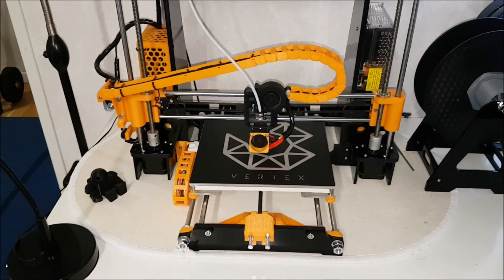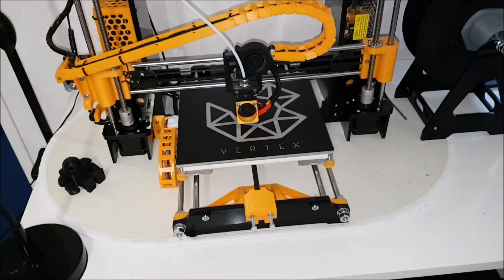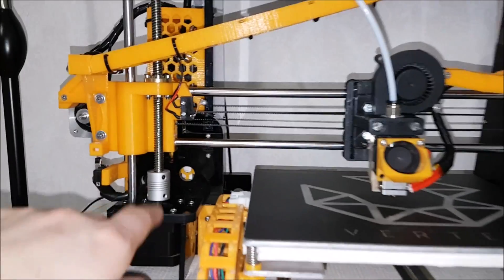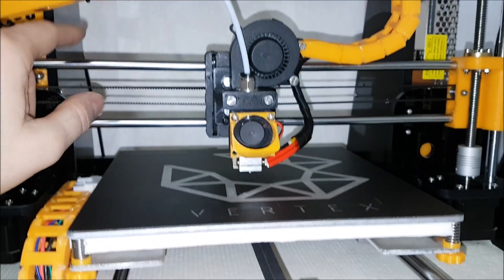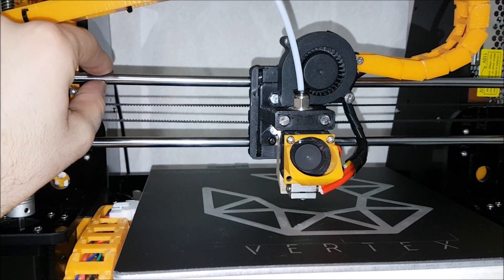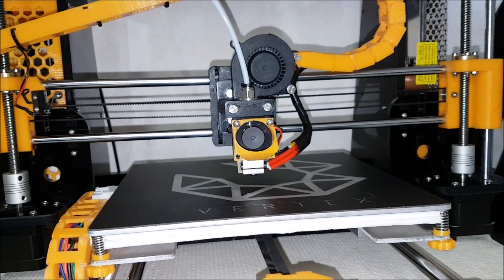This video is about bed leveling, but there are a lot of other things you need to consider first. What kind of surface is your printer on? Are all screws tightened? Are all distances the same — especially on both sides? You need to perfectly match all distances before going to bed leveling. I'll also cover the rods, because mine were bent — I noticed because the nozzle was going up and down as I twisted the rod.